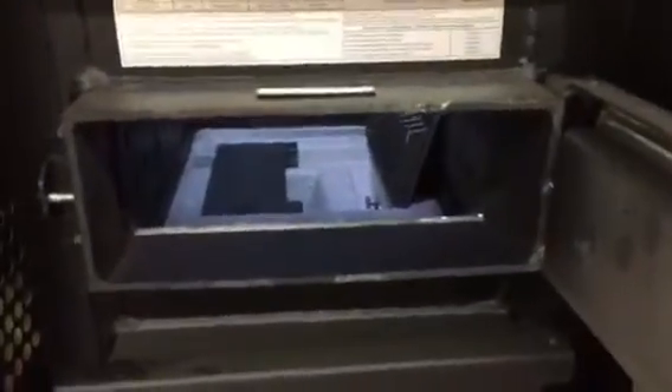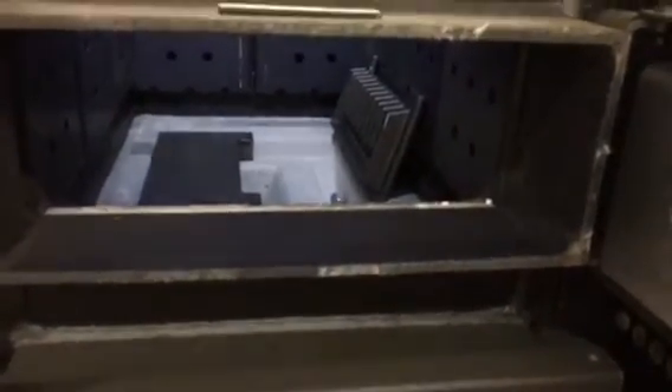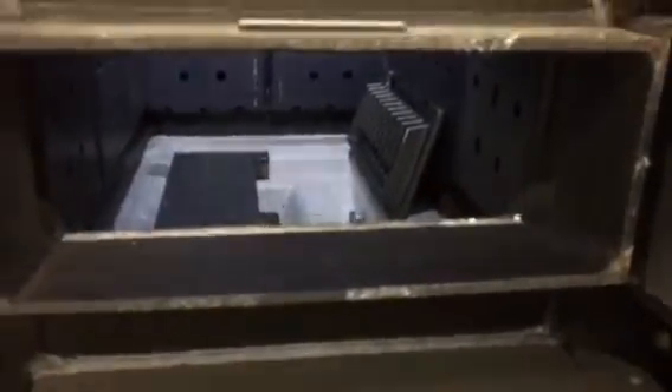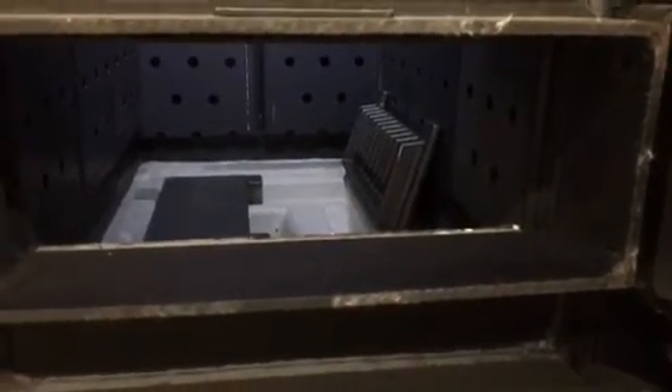After filling this boiler, the loading door is closed and the lighting door is opened. This is a really neat feature — you just ball up a bunch of paper or cardboard in this opening and ignite it. The induction fan pulls the flame right through the base of the wood load and it ignites really fast.